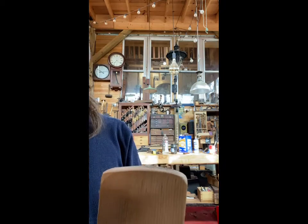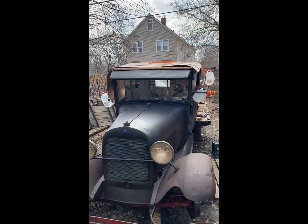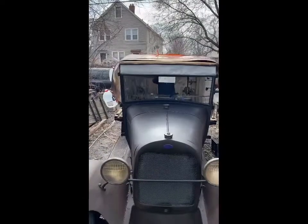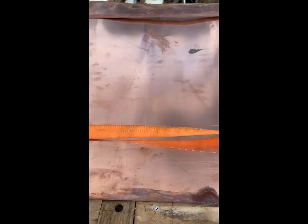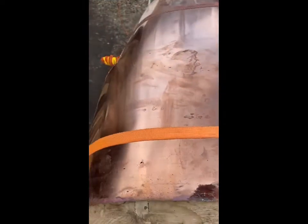We're going to see what happens — I don't have an English wheel. Now some of you might recognize this is hillbilly stuff, and you'd be right. I can see there are creases in the copper, and I'm hoping a little weight will help. I don't have sandbags. The copper is springy right now. I could take a torch, but then it gets somewhere between springy copper and pizza dough — if I heat it up it'll get really soft. I'll do that as a last resort. There are a couple of damaged creases up there I might have to hammer out.